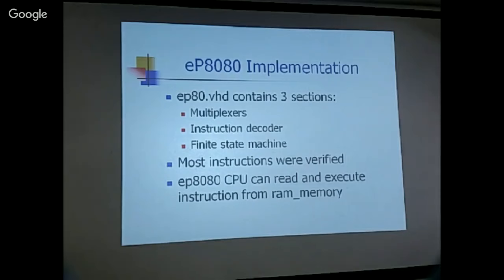And depending upon how many clock cycles it needs, you have to use what are called phases. You know, one instruction needs 1 to 5 clocks, okay? And I call them phase 0, 1, 2, 3, 4. So each instruction, if it has multiple phases, each phase will call out what's the next phase it has to execute, okay? And of course, at the last phase, you just reset phase to 0, and it will start the fetching cycle again.